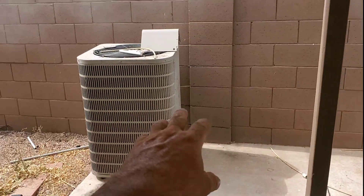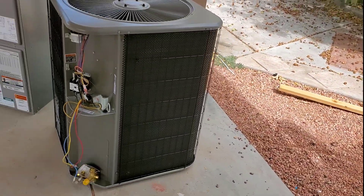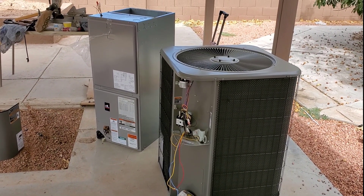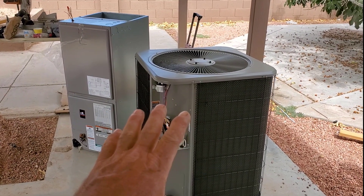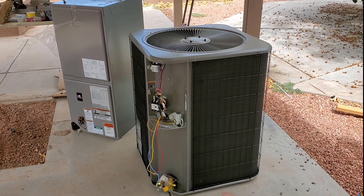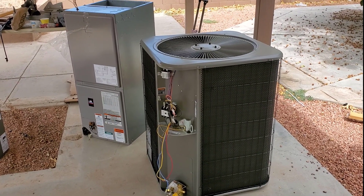This won't be hodgepodge in that old Goodman like I originally planned, but finding three-phase R-22 compressors became a little more difficult, especially that size and that voltage. Most of what we work with is 460 volt and I need a 230. We got the Lennox for free. It's going to need a couple modifications because it's not even a heat pump condenser, but I think I could convert it to a heat pump.